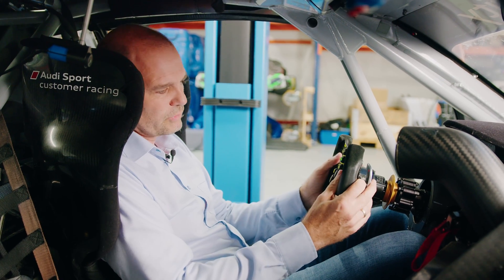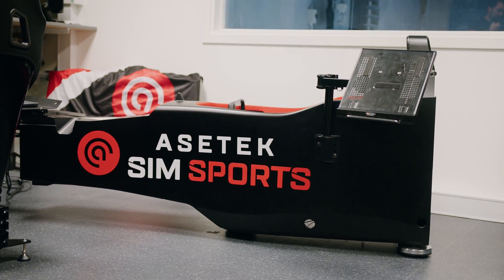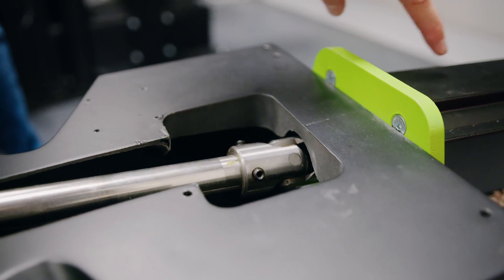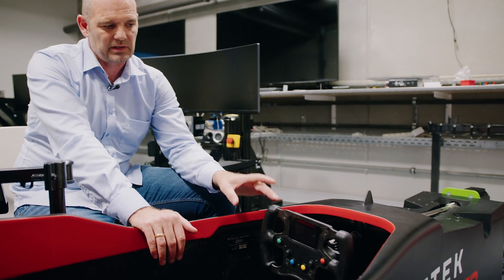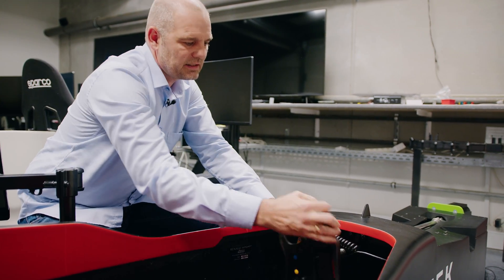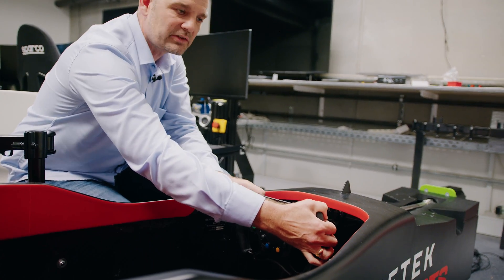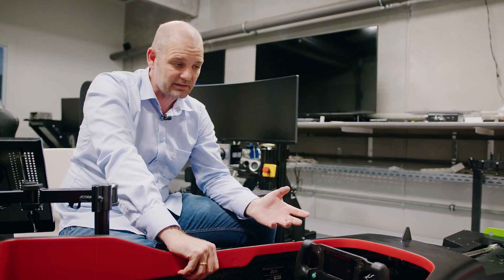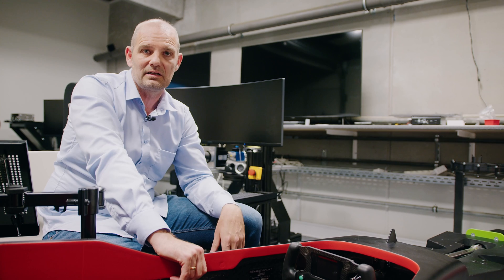Unlike in your living room where you want everything to be perfect and sturdy. What we have here is a monocoque from a real race car — a real formula car — made with a steering column. You can see there is a joint, then the steering column, then the quick release and the wheel. Even in this previous generation steering wheel from a real formula car you have the wire, and it's actually a hassle when you are in the car. You can also hear there is quite a bit of play. Again, most of you would hate that, but in a real race car it doesn't matter — you put the wheel in and you race.